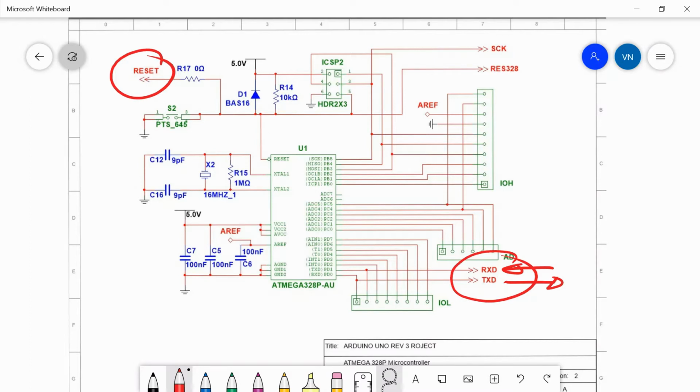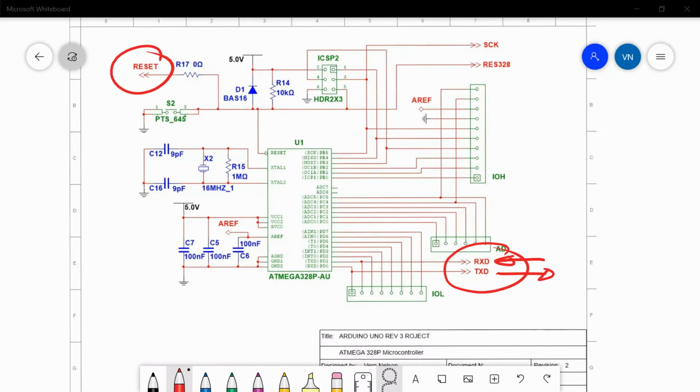This kind of a program is called a bootstrap program or a bootstrap loader, and its sole job is to be a core program that can't be erased so that you can put in new programs. Whenever you do a firmware update on a small device, you're dealing with the bootstrap loader program that's built into the device. All of these processors have a hardware backdoor built into them so that you can download and program in that initial bootstrap loader.